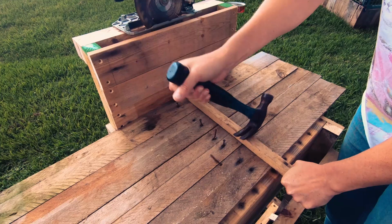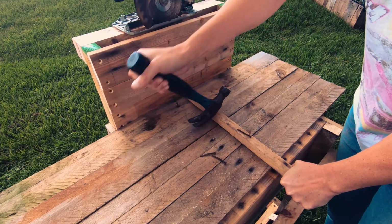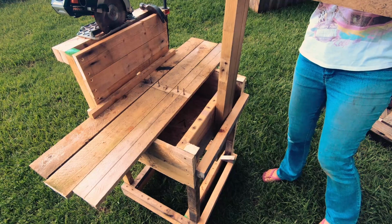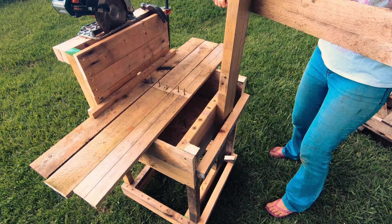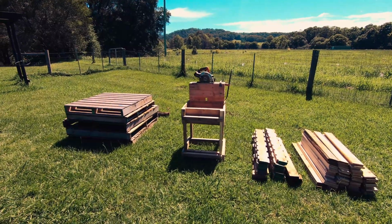Insert the block. This helps with the removal of the nails and also clamps all the palings down so they don't move around. Insert the middle stringer into the front piece to lever off that last paling. It is quick and easy.